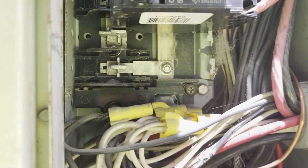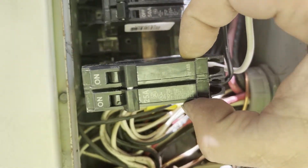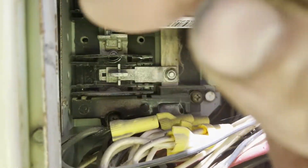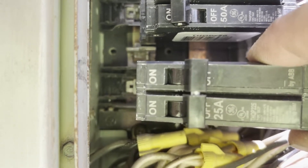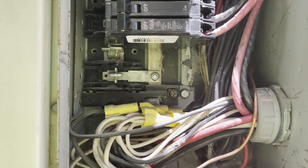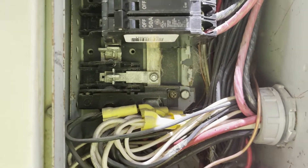If we just put this breaker in between two plastic fins on the same side, we would just have the same lug of 110 and it would not work — it would not power something that requires 220 volts. Instead, we're putting it here, splitting it and tapping into both legs of 110 power. That's how on a GE box you can achieve 220 volts.